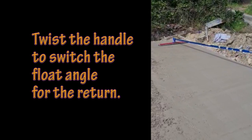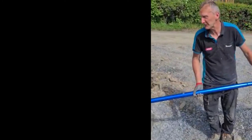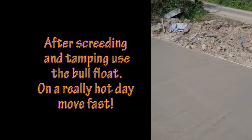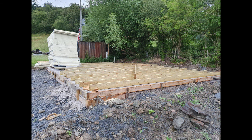You can set the float the other way to lift it the other way and come back. You've got to catch the concrete just right — leave it too long and you can't work it. We got the last section right, going up and down, and it came out really nice. You can then lay out a joist just to check everything is level — in this case we're putting a damp proof membrane across the top and the joists will go on top of that, but here we're checking the base is level by putting one across diagonally.